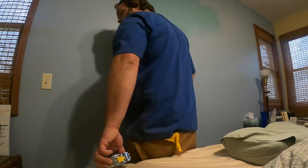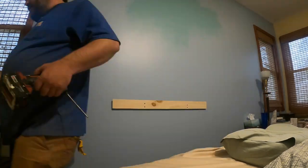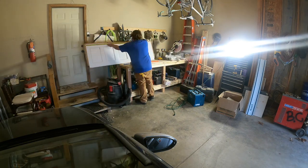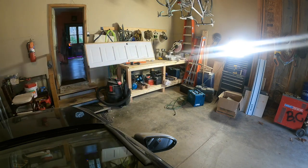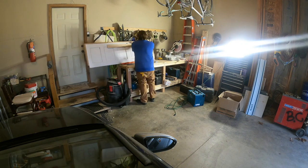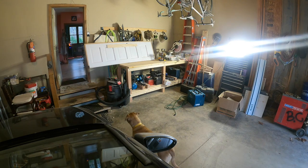Then I go in the bedroom and mark out on the wall — excuse the mismatched paint, there were some sticker letters on the wall when we purchased the home, I scraped them off and thought I had matching paint, but it turns out we don't, so we're going to be repainting that wall. I get the first half of the French cleat mounted on the wall, then come out to the shop and mount the second half on the door itself. Then you just carry it in and slide it right down the wall until it matches up with the cleat. Then I put two screws through the door into studs, so it's really super rock solid.